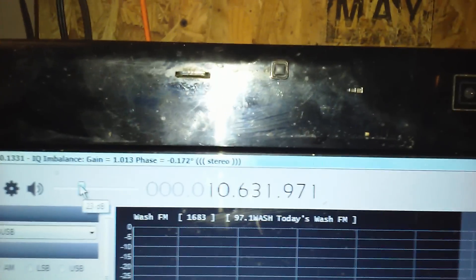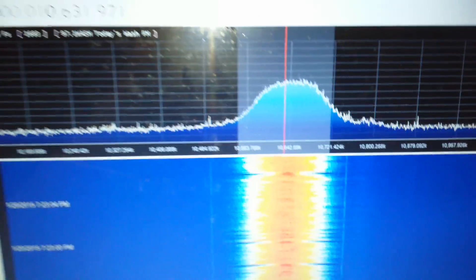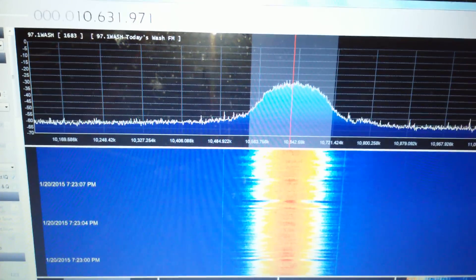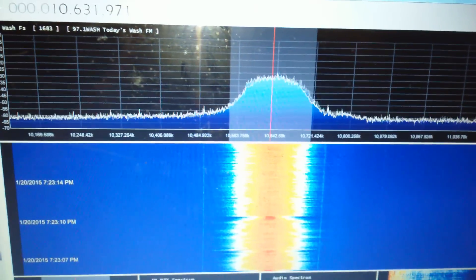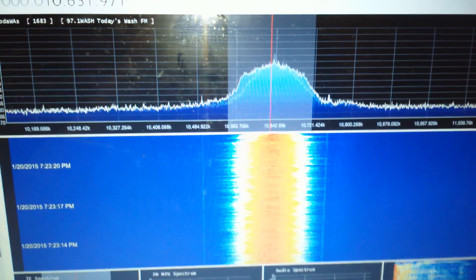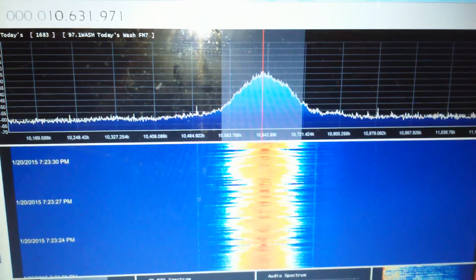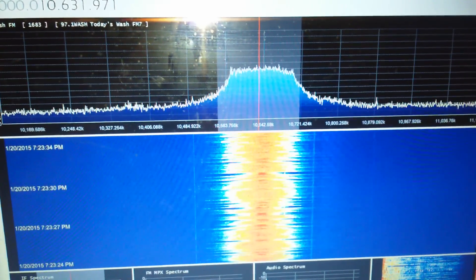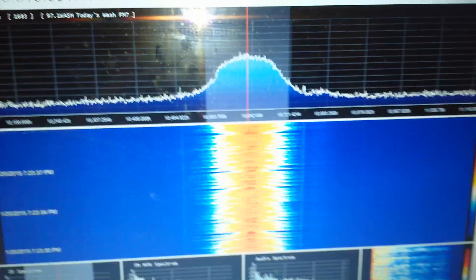There's some audio here. It is very clearly an FM station, as you can see, and it is coming in in stereo, because essentially all we're doing is we're tapped into the exact same signal that the FM decoder actually runs on. It's super heterodyne — there's a conversion stage, and your radio itself is tuned to one fixed frequency while you control the oscillation in some of the RF front end stages. Hopefully if you really get into this radio stuff you'll start reading about tuned radio frequency circuits, super heterodynes, regens, and some of the other various kinds of radio circuits out there.